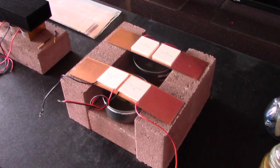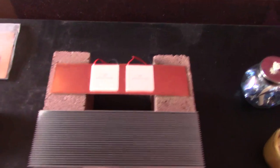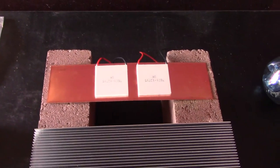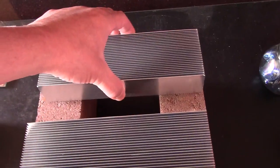One of the best things about doing it this way: I've noticed if you just use one or two Peltier chips, you don't have to use any thermal glues or tapes. You just lay them side by side and the heat sink will lay totally flat on top of them. As long as the piece of copper or metal bar underneath is totally flat, the chips will be nice and solid. That's why I went with a design like this with the two and two — I've never had a chip burn out using just one or two.